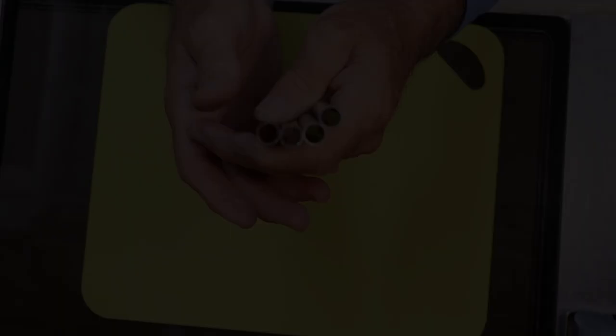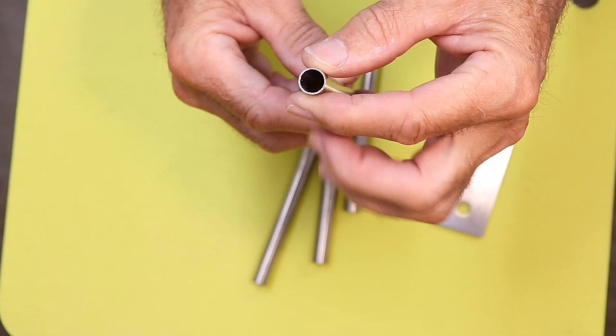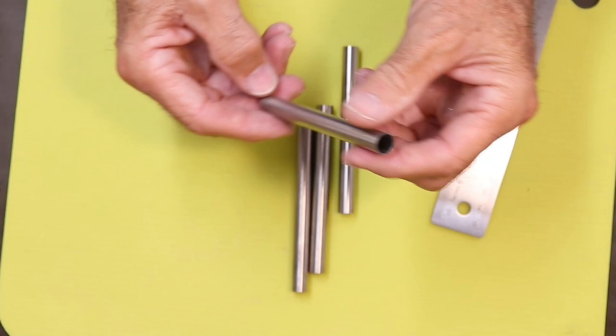So we're gonna be working with these 10 millimeter stainless steel tubes. They're 10 centimeters long, which is just about 4 inches. They're 10 millimeter in diameter. And for you guys who hate when I use metric, it's 25/64 in diameter and 1/64 wall thickness. And I'll put a link to where I got these things in the description.